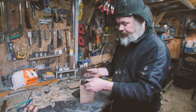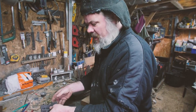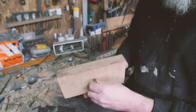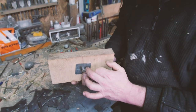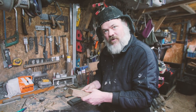Looks great, but if you're going to go to the trouble of hand-making rivets, it's nice to fit them properly and to close the head of the rivet against the rove. So essentially, when you put that on there, you can see that's our mark. So what we're going to try and do is cold form that and close the rivet without damaging the wood.